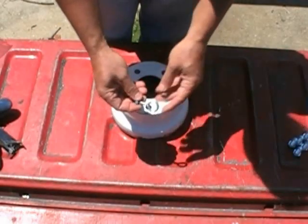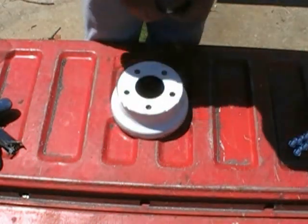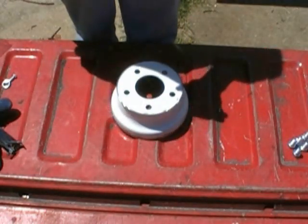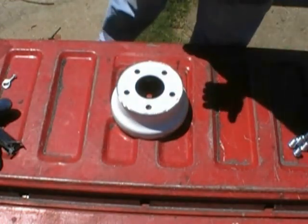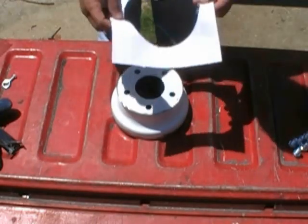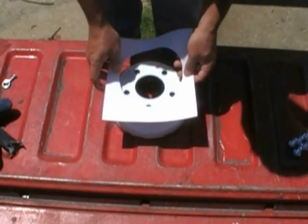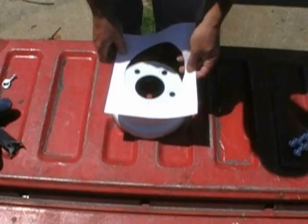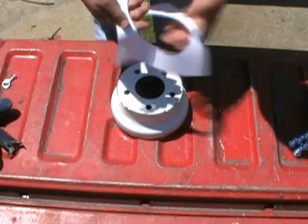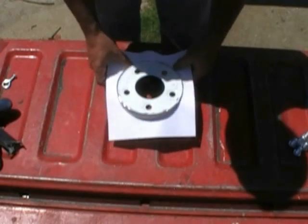I've got these guys right here, okay, and I'm going to drill 3 holes. So one goes here, here, and here. They'll be 120 degrees offset with each other. Now to do this, I took a shortcut because to me it's simpler like this, and I am computer literate. So what I did is I used a program that allowed me to measure this and draw me a circle that's the same diameter. And basically what I can do in that circle in the computer is I can rotate it by degrees. And so what I did is I drew me a line on the circle and locked it in place to the circle. I rotated it, did the same thing, and I did it one more time until I had 3 lines that were 120 degrees offset with each other. Then I just cut the circle out, and now all I have to do is do this number right here.